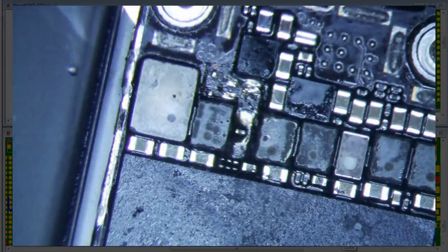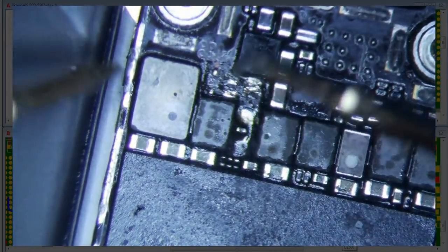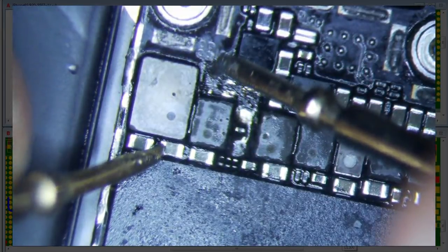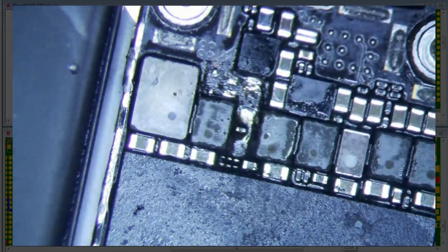So we're going to change our multimeter to resistance mode, and it should be right around 1. If it's like 0.8, then that's a little bit suspect. So resistance of the coil is 0.8. 0.7. So my guess is that that coil is probably bad. So let's just go ahead and pop it off.